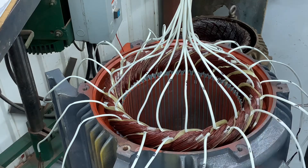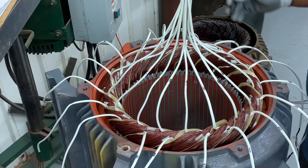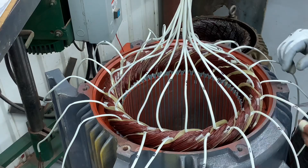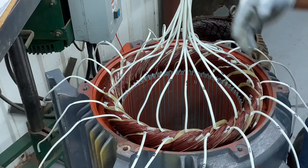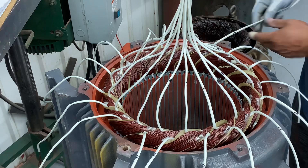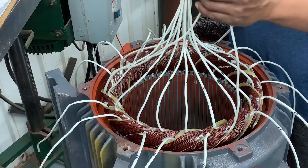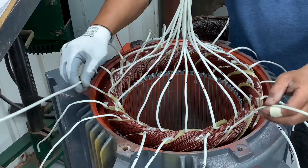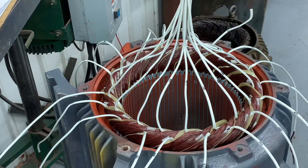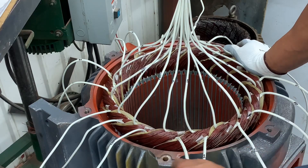Okay, so that's how you connect a 3/6 star-delta, 12 leads — you don't have a jumper. Walang jumper. Lahat ng same number — all the same number — that's your line, 1 to 12. Connect: 1, 1, 1, and 1 — that's your line 1. That's the process. I'm going to start connecting now.